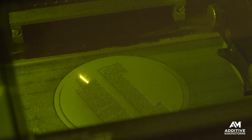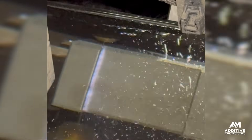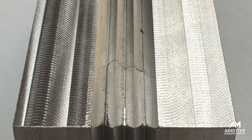The bevels improve mechanical engagement and provide good surface area for the metallurgical bonding to come. The sample parts in this video were 3D printed using laser powder bed fusion out of 316 stainless steel, made by Trumpf on their Trueprint 1000 platform, which has a build volume measuring 100 millimeters in diameter by 100 millimeters tall — a perfect example of the small-format 3D printer discussed here. After printing, the dovetails are slightly oversized and need to be cut down using wire EDM. Synergy partners with Falcon Industry to smooth those surfaces and bring everything into the correct tolerance so the dovetails fit together perfectly.